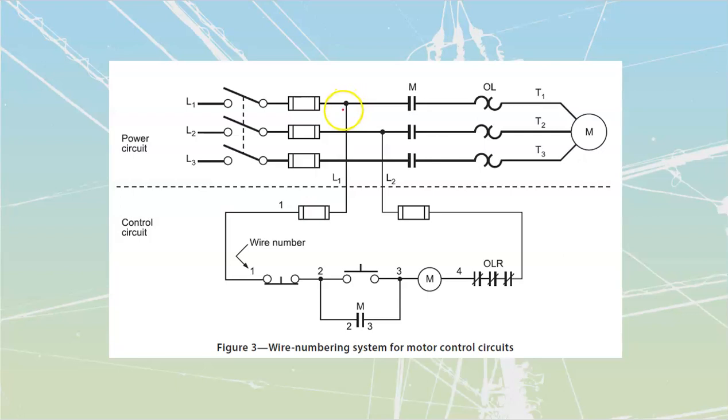Starting with this one over here — it's attached to my line one, so I'm going to label this wire L1 here, and also label L1 over here. Then on my power circuit, this is going to be my L2 over there. At that point we hit these two components, which you have identified properly as being fuses. We just pick a side and drop a number — that's all we're going to do. Every time there is a device, we have to stop and change numbers. Starting over here, we start with number one. I put it right next to the terminal and carry it all the way down. That's wire number one.